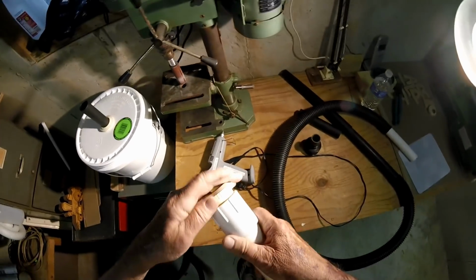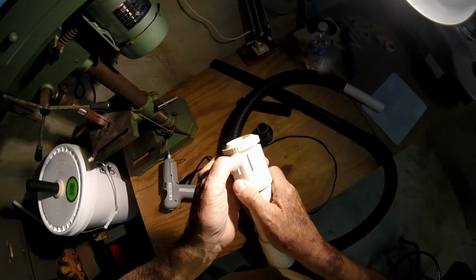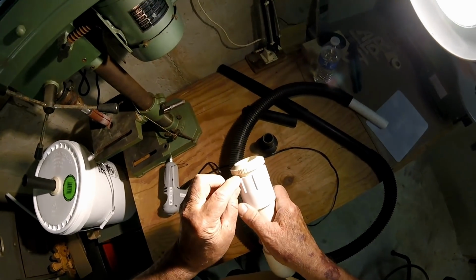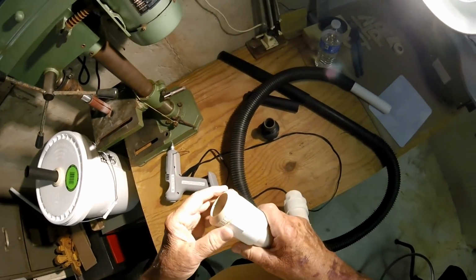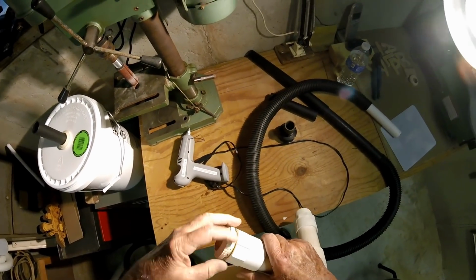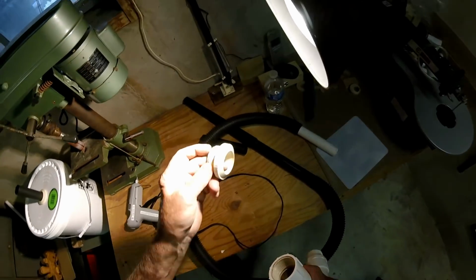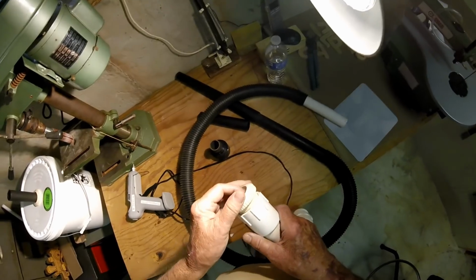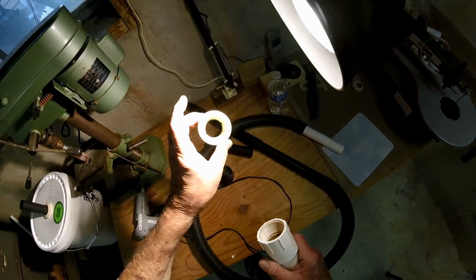But since it doesn't quite screw all the way, it leaves a gap that's thicker than the thickness of my bucket. That's why I cut the oak washer and put on there. Then when I snugged it up, it's downright tight. So, don't ask me what you call that duplicate there, but if you wanted to use one of these to build a shop vac, any swimming pool supply place would have them.